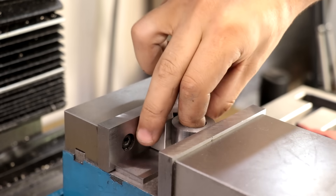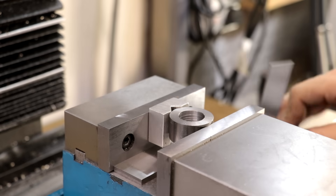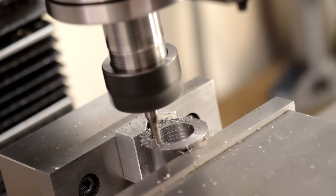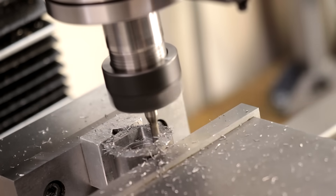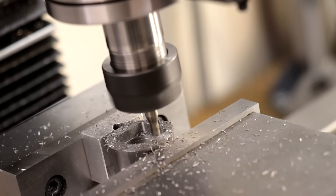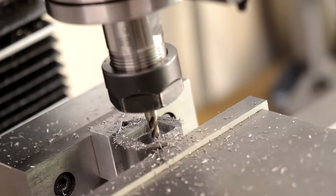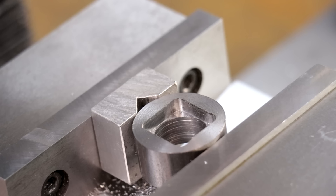The next method is going to be to use a milling machine to open up and square up a hole. This method will probably work best if you have a digital readout or a CNC machine, but all you really have to do is mill out each corner. You will leave a small radius in each corner from the end mill, so it's best to use a small end mill if you can. That is the result I can get in about a minute. The big advantage here is that you don't need a through hole — in the other two previous methods it had to be filed all the way through, but here it doesn't. Doing it this way means you'll be able to have a transition between having a square on one side and a round hole on the other, and the transition allows it to act as a stop.